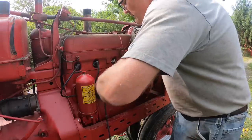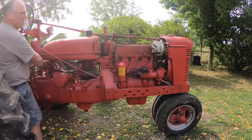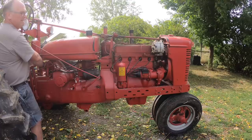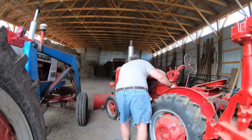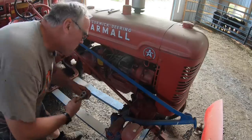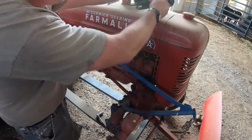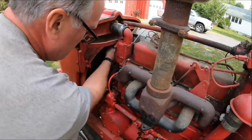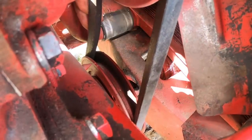In a Hail Mary move, I try putting the magneto with its new coil back on the tractor. I crank and crank and crank, but no fire. Luckily, I have another option short of sending the magneto out — the Super A that's in the upper barn has the same model magneto in it, and I know that it works. But to be certain, I'll start the tractor before I take the magneto off. Of course, the battery is dead, so I have to use the 504 to jump it. I take the magneto off the Super A. Before putting the Super A magneto in the H, I have to get the engine back to number one piston, top dead center of the compression stroke. Then I take the magneto back off of the H.